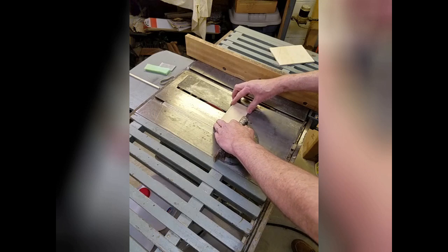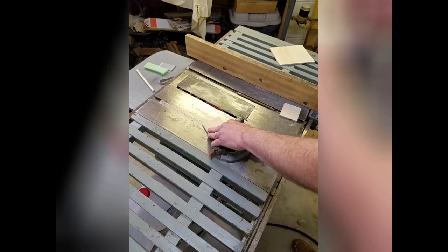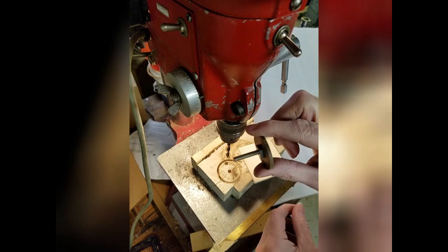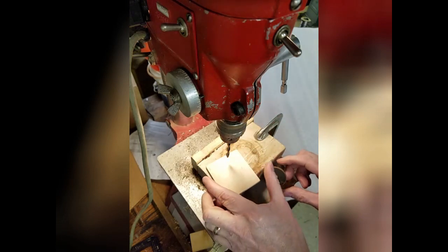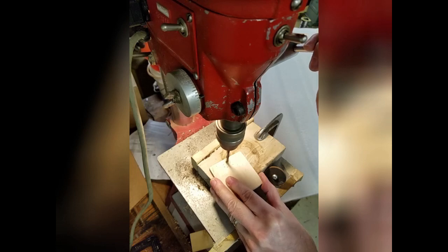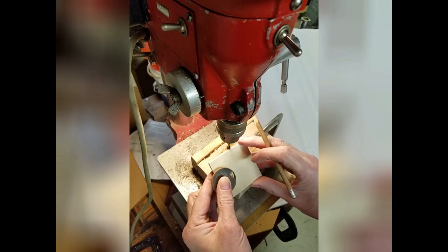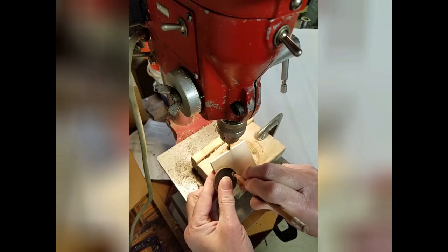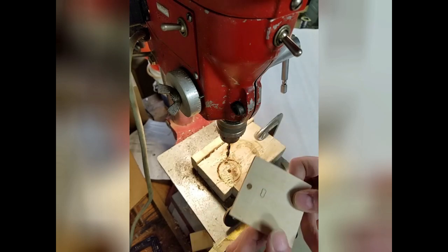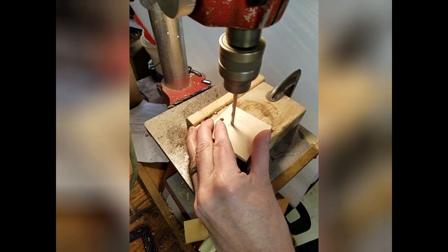Next, let's cut out a base for the sensors. I used a piece of 3/16 inch plywood and cut a small piece that I could mount the disc on. Drill the bearing hole for the disc in the base using a bit that is the same size as the bolt that will be used as the disc axle. Then mark the location of the photocells on the base using a pencil through the slot in the disc. Use a drill bit that is the same size as the photocells to drill two holes next to each other in the base.